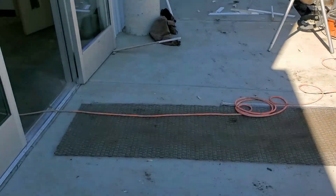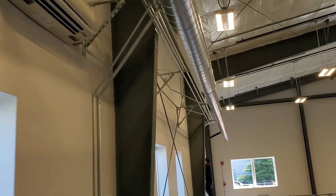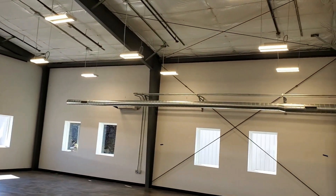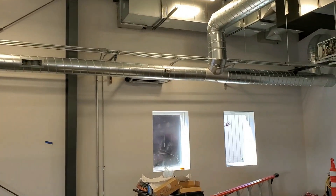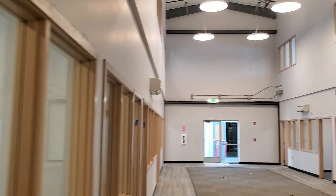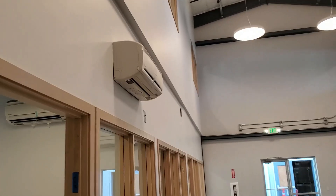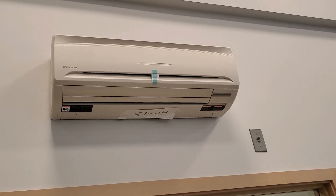Walking the building, we can see most indoor unit fans are open and running. We find one unit where the fan is not open — that's the one not communicating with the outdoor unit. From the outdoor unit I commanded all the indoors on, so this is the unit that's missing from the address count.